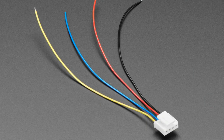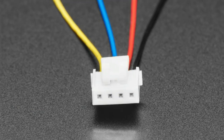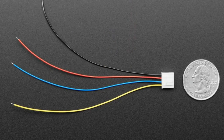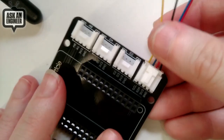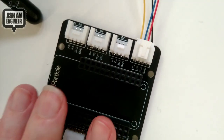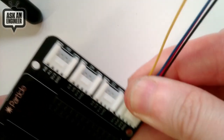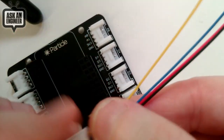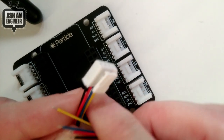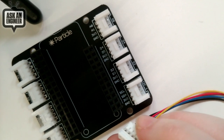We've got this Grove pigtail cable. This is a cable you can use to plug into devices with Grove connectors — I even have one to show off. Can you go to the overhead? So this is like a Grove Feather Particle adapter. These are Grove connectors from Seeed, used for digital, analog, and I-squared-C. A lot of people want to make custom cables or extend them. This cable plugs in and it's even got the little latchy bit — you can sometimes shove JST PH connectors in there, but this pigtail just has bare wires on the end, which is great for making your own custom cable. We also have an adapter cable from Grove to Stemma QT if you need that, but if you just want to make your own, this will do the job.